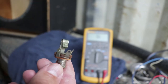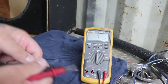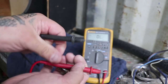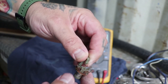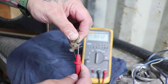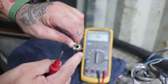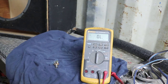There are two tabs on the side and I wasn't sure which one to use, so I figured it out with my meter by checking for continuity. I put one probe on the positive side of the jack, then went to the ground — nothing — then to the next tab — good — then the next — also good. So I can use either of those two tabs. I think it has two because you might run two speakers, but we only have one, so we just run one wire.